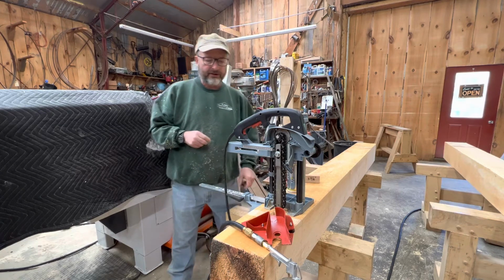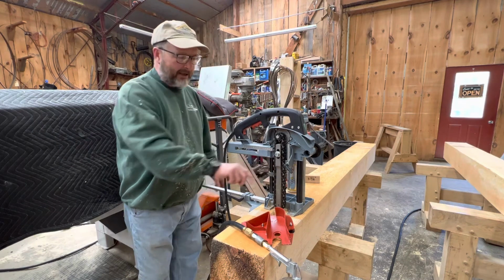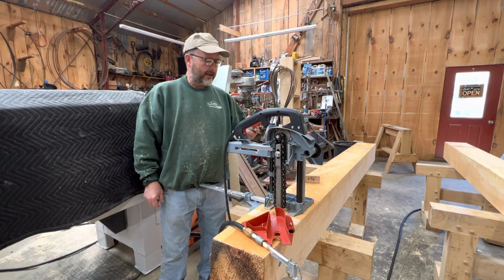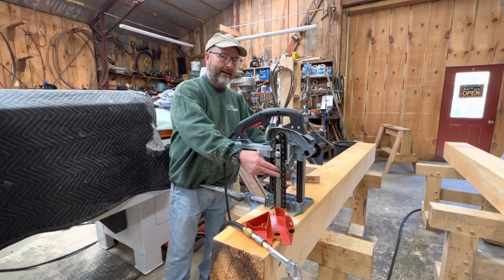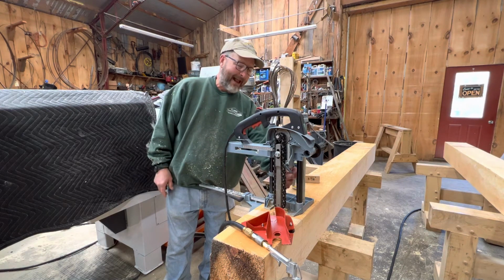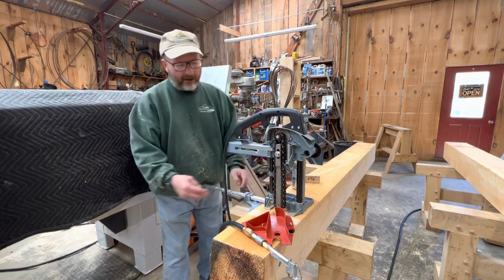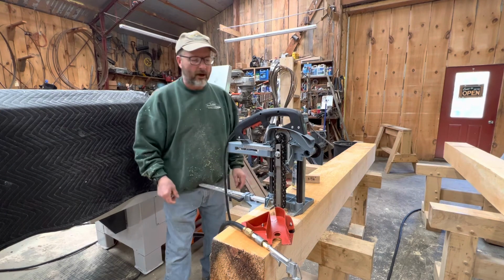The other thing I wanted to show real quick with the cover off is, hopefully you'll see the chain is black and a little bit oily. This I also get at the Timberwolf Tools, the spray-on lube. And just like a chainsaw, you have to keep your chain lubed or you're going to wear out your bar. And these things are pricey. So every day before you go to use it, you want to be putting a coat on the back side, top and bottom back side, on the teeth, and on the front side, same as the back, in these grooves here. Give it a good coat.